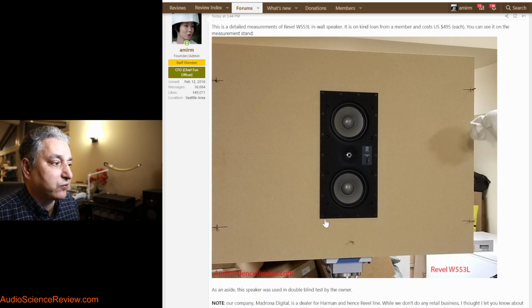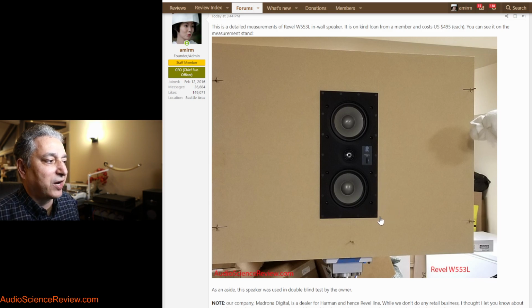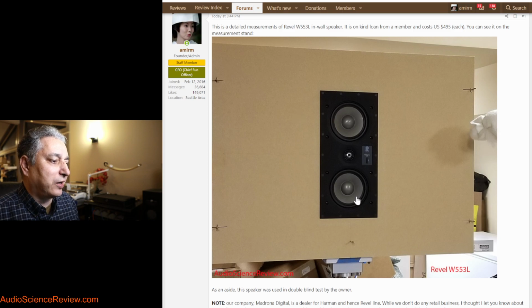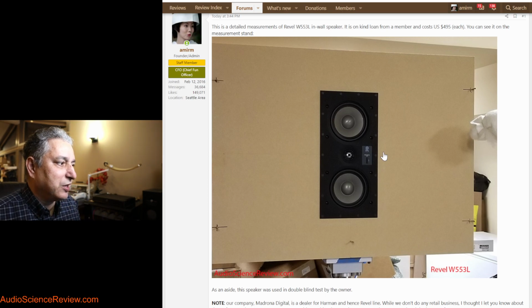If you build a back box for it, it's just as well as broken, because you get diffraction around the edges. The back box has to be sealed, and it's a mess. I started that way, trying to economize without this software module, and it just doesn't work. So this is the way to do it. The system has some limitations, maybe I'll talk about them at some point. But in this case, it actually is pretty ideal and worked well.